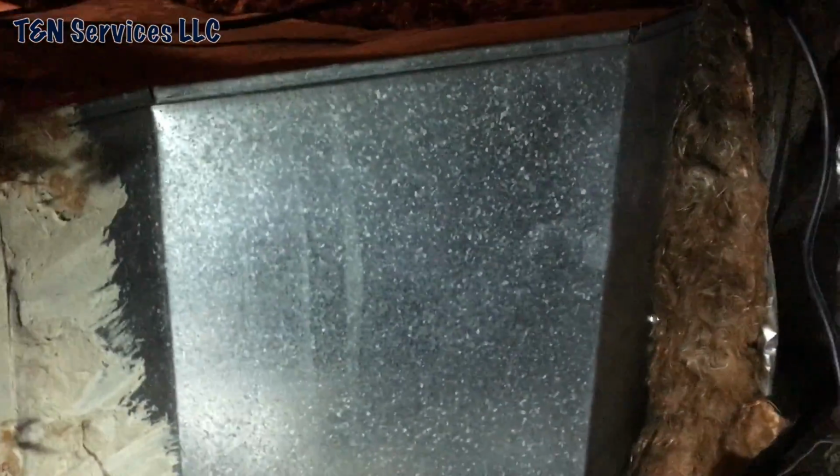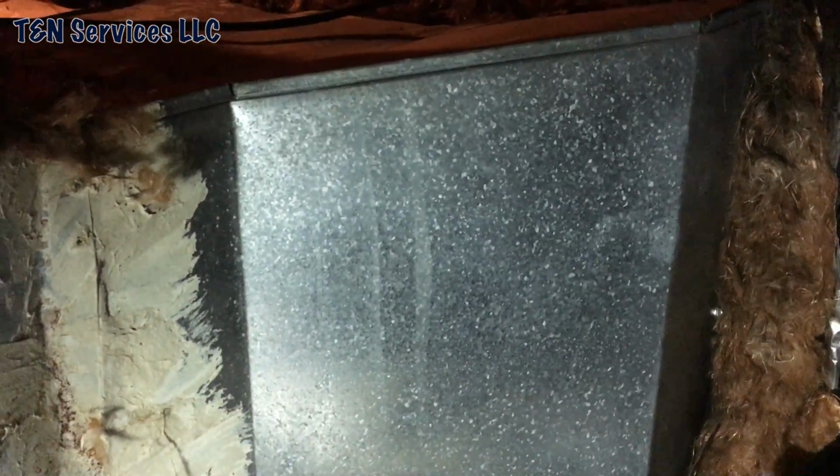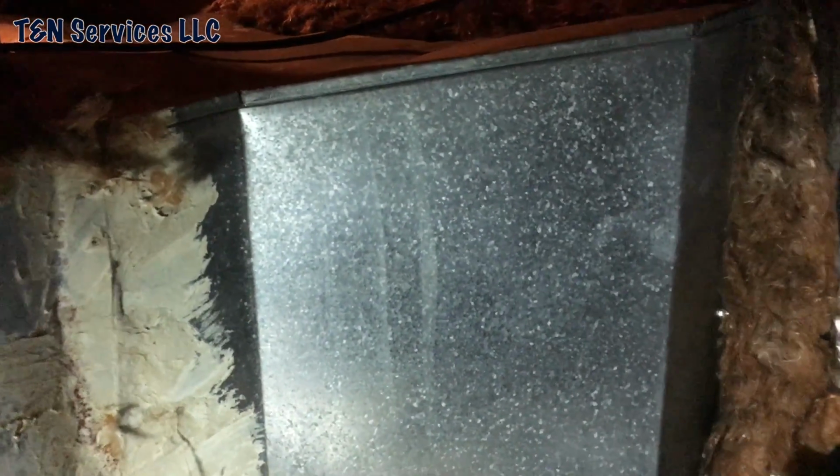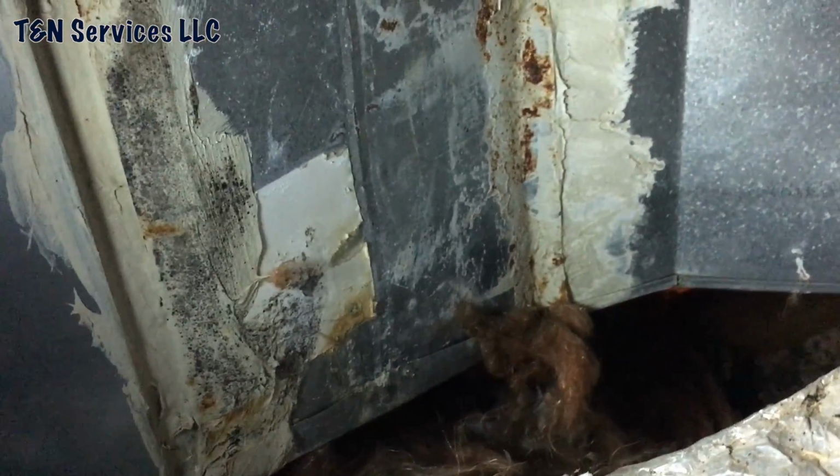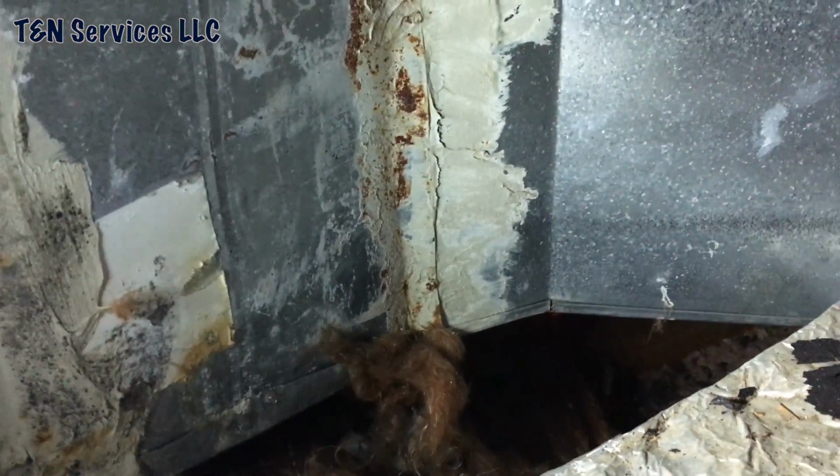And it just depends on where the slab coil sits as to where I cut all that off. I'm not going to try to square it off. If it's coming in, I don't care unless it's smaller than the opening of the slab coil. So if the piece is slanting in, you can see how it turns in like that. If it's smaller than the opening of the slab coil, then yeah, I'll make it at least even with that, the same width, the same opening size. But yeah, we just take some screws out and bust the mastic up, and then we'll just make it look like it's supposed to, as best we can anyway.